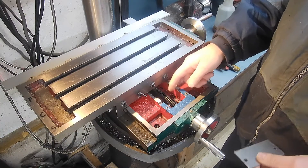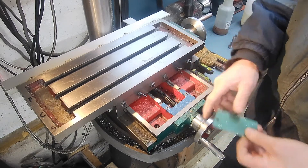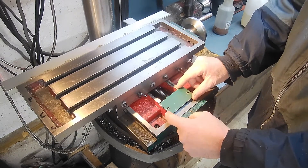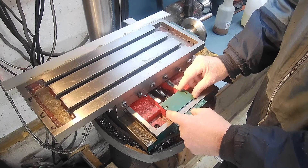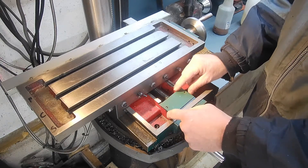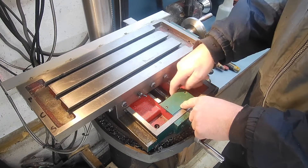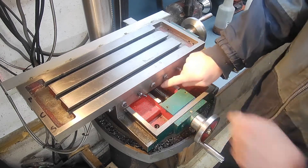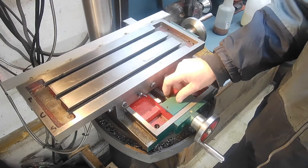On the original build, you have the lead screw and a cover for the bearing. Originally it was just this tin plate that sat up there — not very effective; it just keeps chips from falling directly into the bearing, but it's open on the end. The big problem is it sticks way out, and the block for the Y carriage ends up hitting it first.